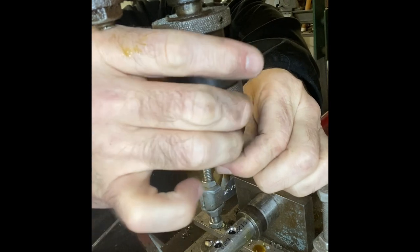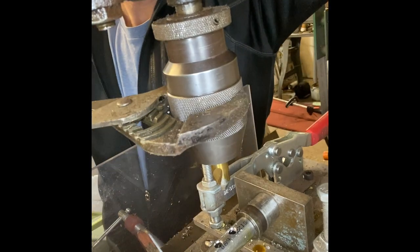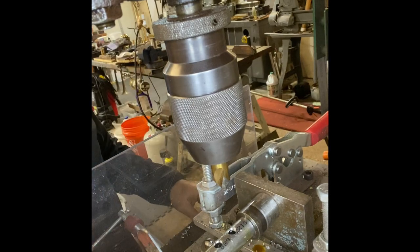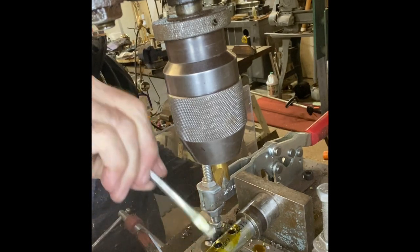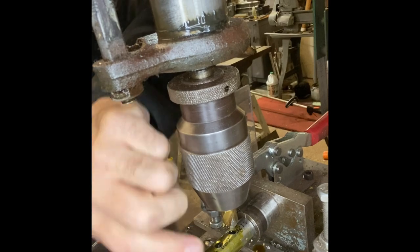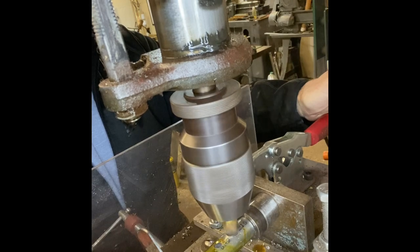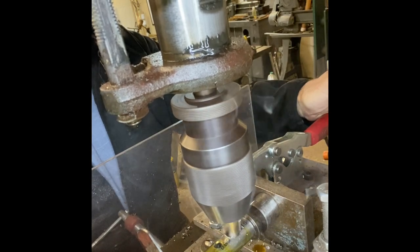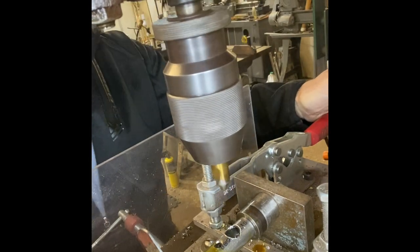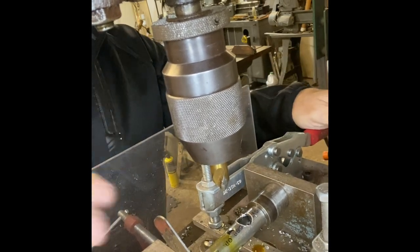The hole size I'm going to is half inch — 500 thousandths. Oil helps; it's a little smoky. Monel is a very soft nickel alloy that is very difficult to work with — it wants to work-harden as soon as you start to cut it. I'm looking at making a clean pass through the material so I have a half-inch hole to work with.